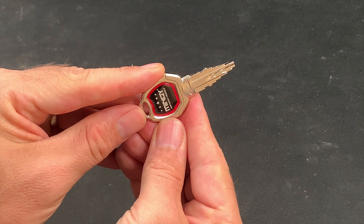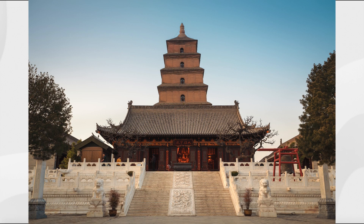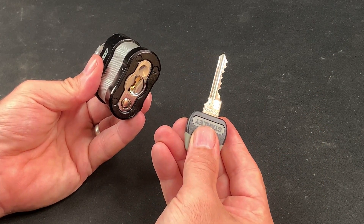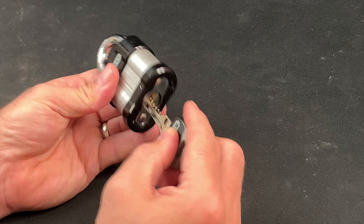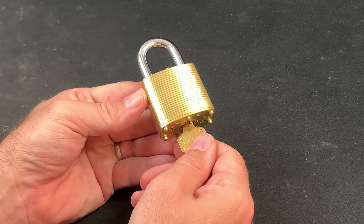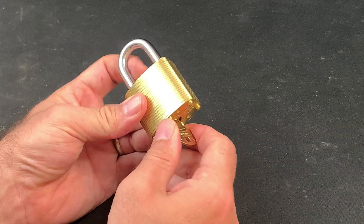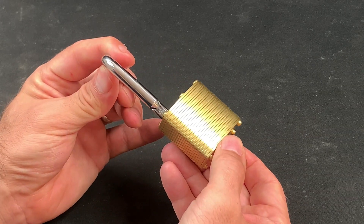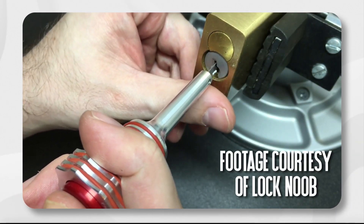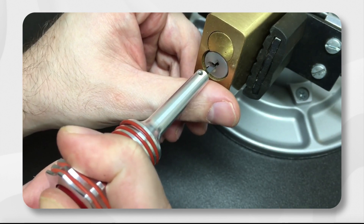The name attributed to the keyway of the Mindy Hardware Lock is a Pagoda keyway. The feature of the 50mm Stanley laminated lock which makes it a challenging pick is the fact that it comes with counter-milled chambers in the core, which are designed to catch against those serrated driver pins. On a scale of 0 to 10, the spring tension of the Marine Commando Lock is a resounding 0 because it's a dead core lock, and in order to remove the shackle you need to use a plug spinner to turn the keyway counter-clockwise. Unfortunately I don't yet own a plug spinner to put this to the test, but I really like this hidden knowledge gem.